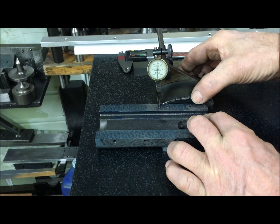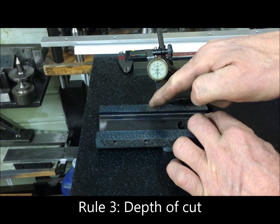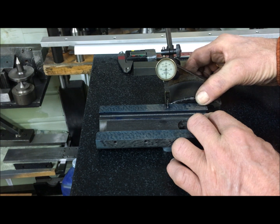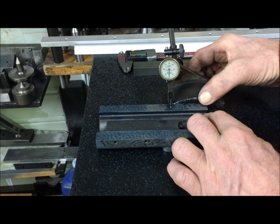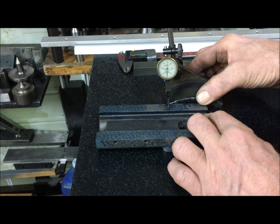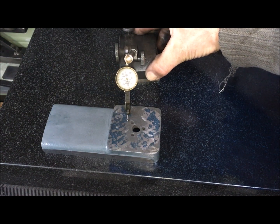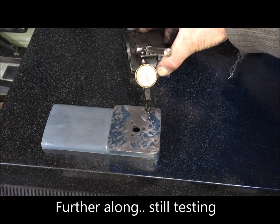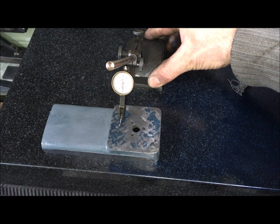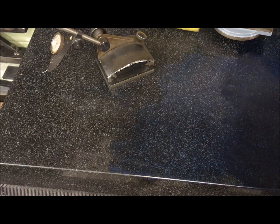Now to show the third rule — scraping depth of cut. I'll just indicate on top of the part that I have finished scraped, and you can see the needle fluctuates from high to low points. That's to prove that you have some scraping depth. Higher here, still high — this low in the middle is okay. I'm looking at low spots here, but I want to have it higher in the perimeter anyway.